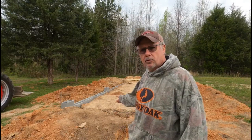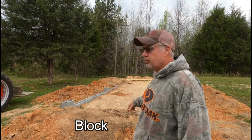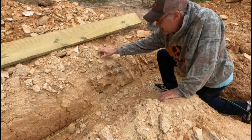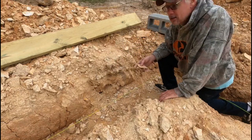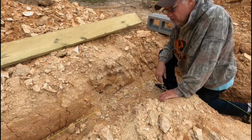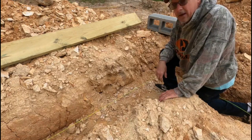Good morning and welcome back. It's a little overcast this morning but it's a great day to be outside and get a little work done. The birds are singing and it looks like it's going to turn out to be a beautiful day. As you can see behind me, I've already got a few courses of brick run. I went through and pinned all my corners to make sure that I'm square so we can get this done as quick as possible. Up here on this end we run into a lot of limestone - fortunately it's kind of soft, but when you're removing it by hand it can be a little time consuming and a little back breaking sometimes.